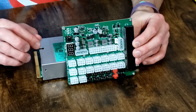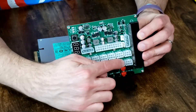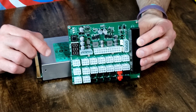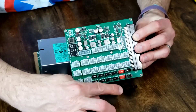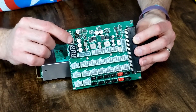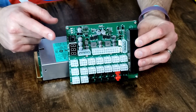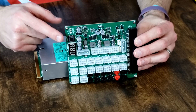So let's quickly go over the features of this thing. This thing highlights 16 PCIe 6-pin power plugs. It highlights an integrated Pico adapter, 24-pin and 4x4-pin CPU power for the motherboard. It highlights the integrated fan hub at the bottom, an integrated power switch toggle, an integrated voltage display, and onboard LED power-in, power-out, and motherboard power indicators.